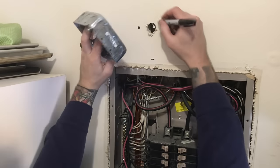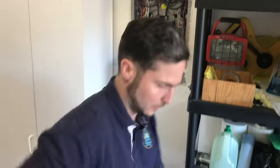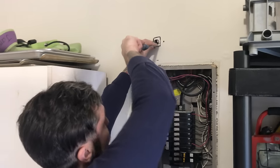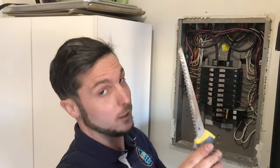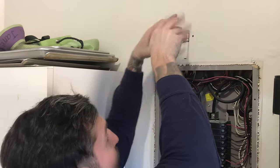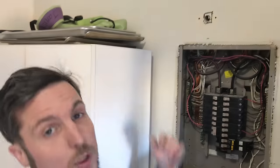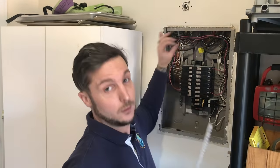The box is slightly bigger, so we just need to make our hole larger so that we can fit the connector through. Now that we've got our initial hole, we can move to our drywall knife — pad saw, whatever you want to call it depending on what country you're in. We're being really light with the way that we're doing this, just using the tip. You don't want to start shoving the whole thing in because there are wires there. I think classic hand tools are always the best way to go — you've got a lot more control and a lot less risk of hitting something behind the wall.